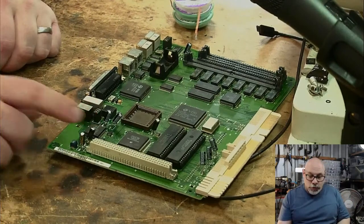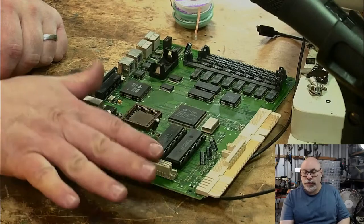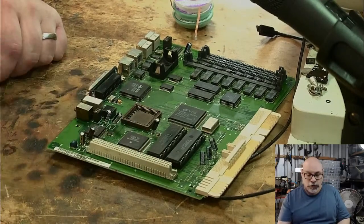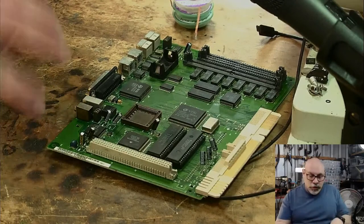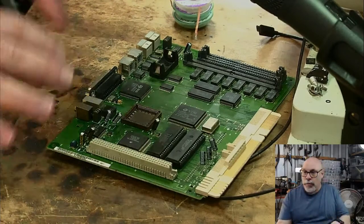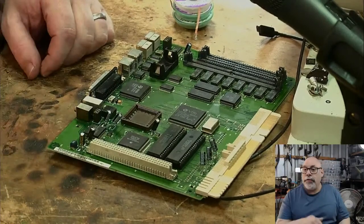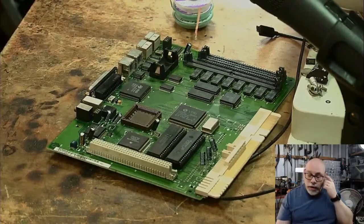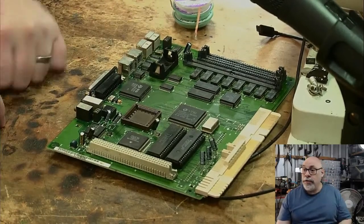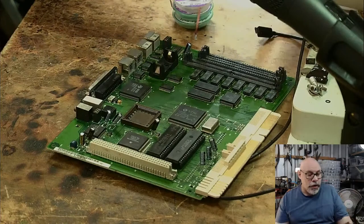And with this one here, these capacitors are having to be bent over so that we can stick the network card on there, because there's no space. As I say, I'm not here to criticise someone for recapping like this, but I think it's a fairly unsafe way of doing it, and I definitely am going to undo it and replace them with surface mount capacitors.